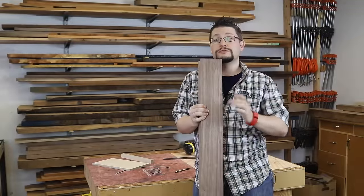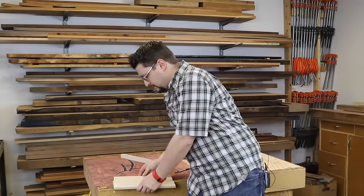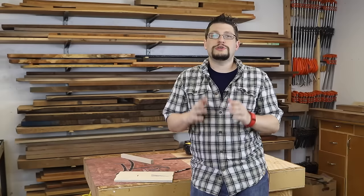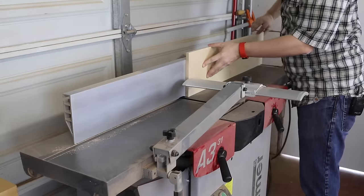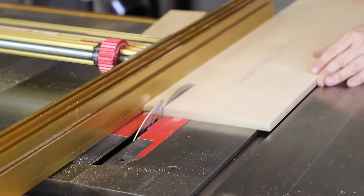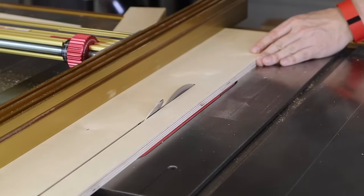After I marked up all these guys, it was time to head over to the table saw because I need to make a whole bunch of parts — right here — these are a whole bunch of half-inch plywood pieces, and they're going to make up the base for the router template that we're going to use to help us get some beautifully crisp mortises on these legs. The first thing I did was I took a piece of half-inch plywood and jointed it on both edges on the jointer. Then I cut a series of strips: the first strip was one inch wide, the second was an inch and a quarter wide, and the third was three inches wide.